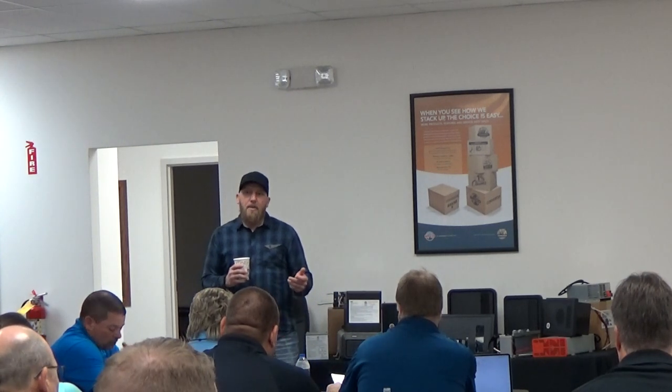Another fact about our converters, this is going to be something you guys hear in the dealerships, our fans are load-based. So when I say load-based, most fans on converters or electrical products out there are heat-based. So when they get hot, the fan comes on to cool it down. So our fan is load-based. So when I say load-based, at about 5 amps of load on the converter, that fan's going to start, and it's going to stay on forever until you get below that threshold.